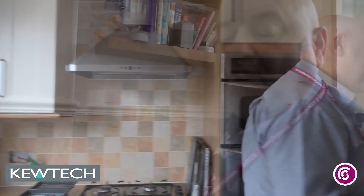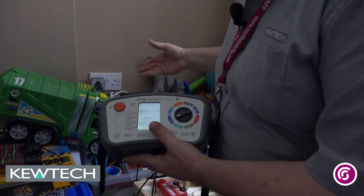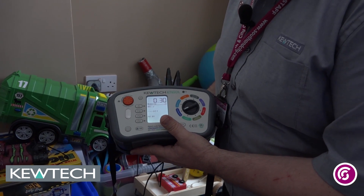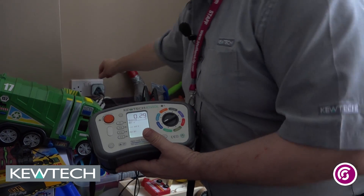In the lounge, testing the socket next to the chimney breast, we get a lovely reading of 0.29. Checking the switch operation breaks the circuit — constant testing shows 'measuring' on screen — then back on we get 0.30: absolutely fine. The adjacent socket is also fine. I personally record all these values on my drawings, noting how many points are on the circuit, and checking for degradation over future testing intervals. If I came back in three or four years and the same socket measured proportionally higher, I could identify degradation taking place.